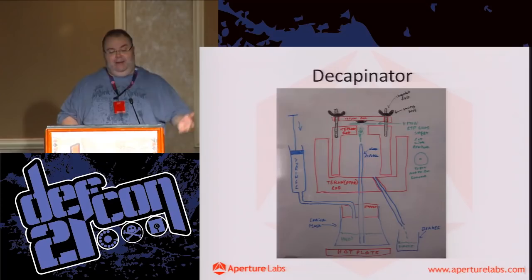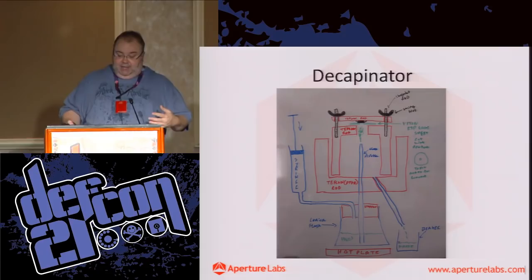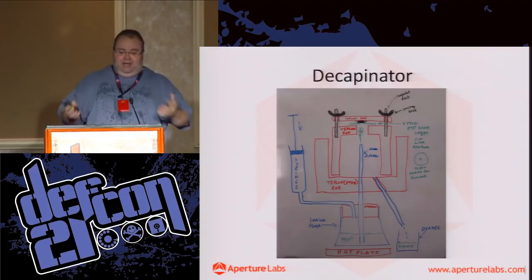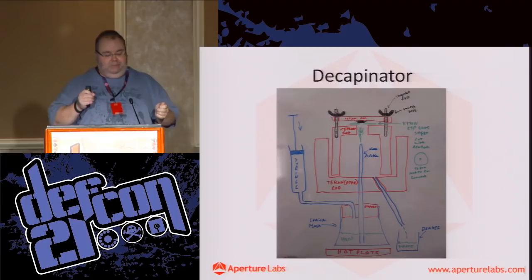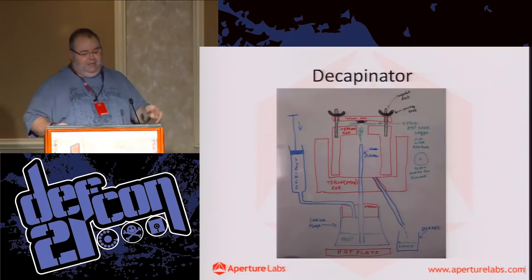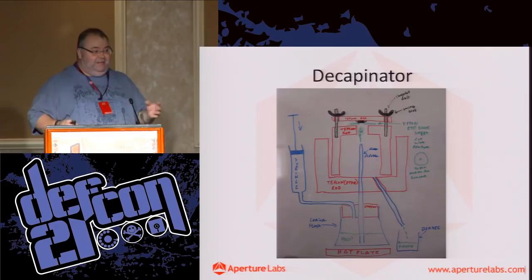The Viton ETP 600 is designed for making gaskets for pipelines that are pumping nitric acid and stuff like this. So actually, I can have the regular Viton. When you look at the specs on how they test this stuff, it's like, okay, we're going to immerse it in nitric acid for 24 hours. And it's like, oh yes, and it expands 5%. And it's like, okay, that's fine. It's going to be nowhere near 24 hours. And even if it did expand 5%, who cares? Not with the stuff that we're doing.